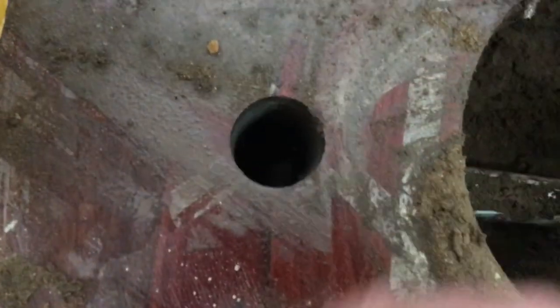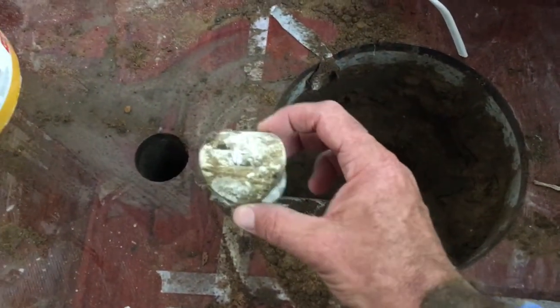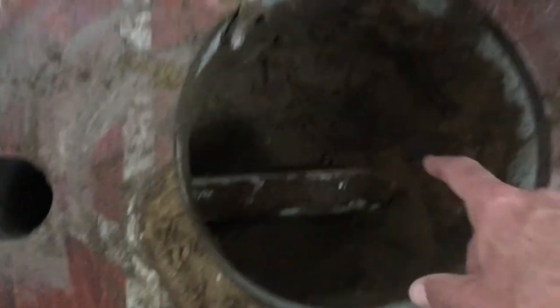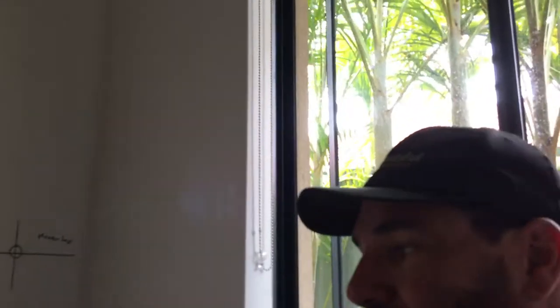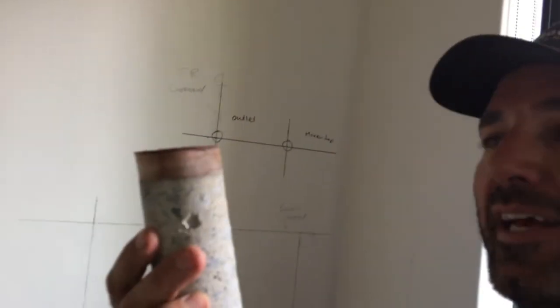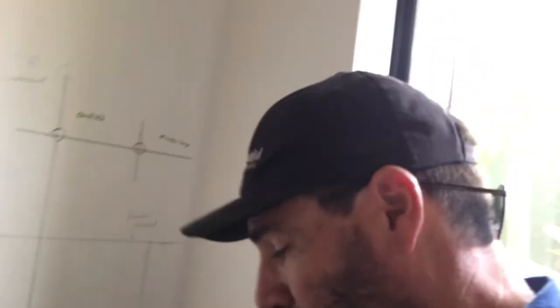He's stuck the core drill right on the measurement — so that was drilled dead center. Now I've got to try to get the 50mm pipe up there connected onto that, and then have another 50mm waste to come up here so when the trough gets installed that can be hooked onto there. We've got the water outlet here, and this is the core drill piece that was cut out — you can see it's got the wood on the top. So it worked out pretty well.